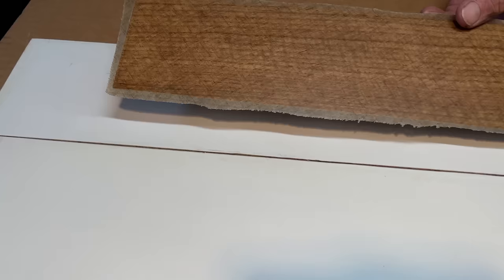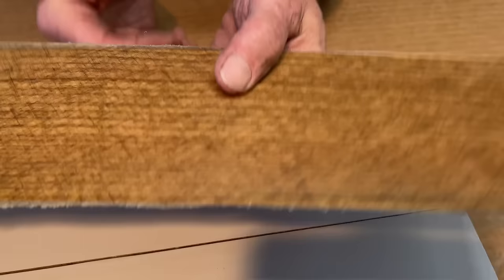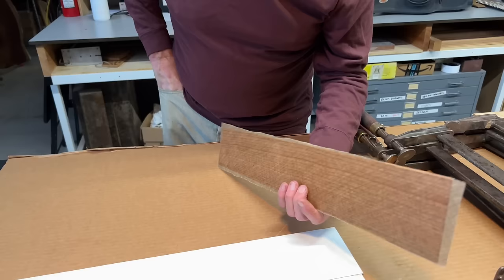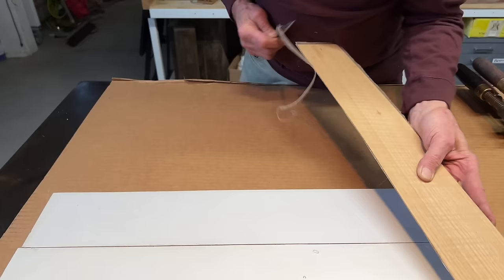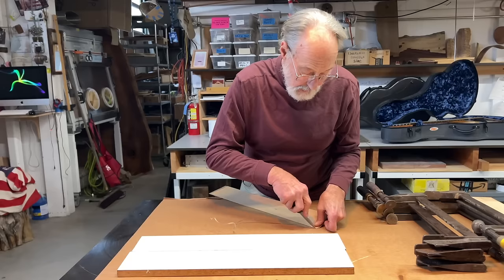This is a nice plastic tape that works as a great release system. You can see the fibers going plus or minus 45. The fibers are all wet — you don't see any holidays or dry spots. In any composite layup, if you have dry material you don't have anything basically. The whole idea of a composite material is a combining of two things to create a new kind of structure. If you don't have wet fibers you won't get the properties that you're hoping to get — it'll be weak, and dry fibers are a problem in any kind of composite layup.